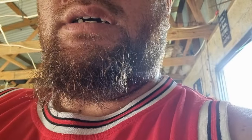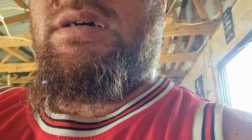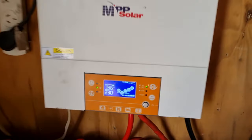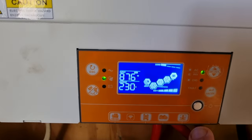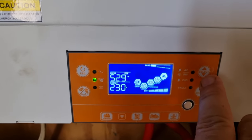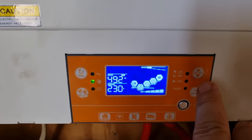What I'm currently running is four panels of the 265-watt in series and eight panels of the 370-watt in series. I should be getting over two kilowatts easily but I'm only getting 1.3–1.36 kilowatts, around 800 watts, sometimes 600. There's a bit of cloud cover coming over right now so it fluctuates.